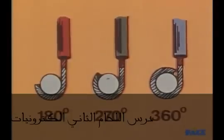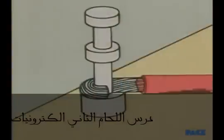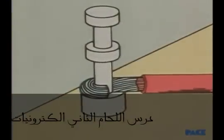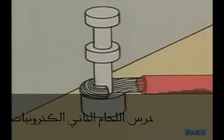We recommend a 270-degree wrap to ensure a tight mechanical connection before soldering. When only one wire is placed on a terminal, it is placed in the lower section, flat down against the base. In this way, any mechanical stresses will be transmitted to the board, not the terminal.